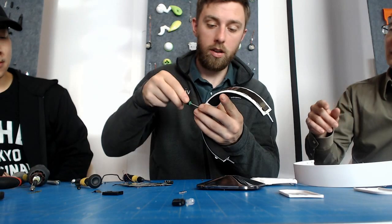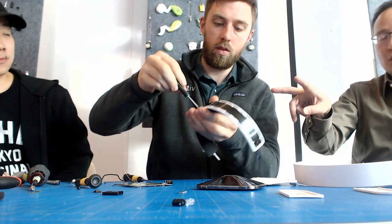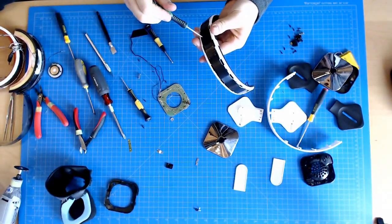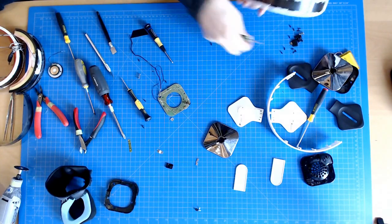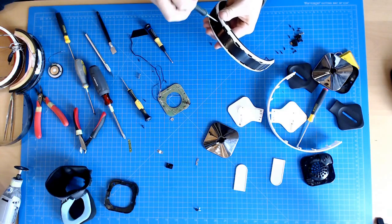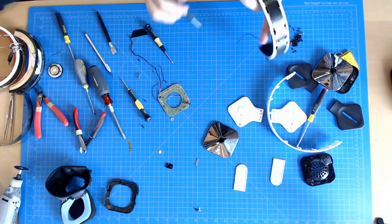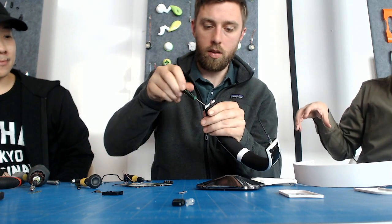Yeah, because it takes a little bit of time for the parts to cure, and on top of that, we wanted to achieve the two-tone color. The white band in the middle is deliberately done there to highlight where the technology is. In order to do the white on black, we shoot the white part first, and then the entire part is picked out of one tool, dropped into another one, and the black shot is done. So for the black, then you can do it in the same mold? Right. We have a version that's all black, and we are able to do it just with a second mold, because we don't need to do the two colors.